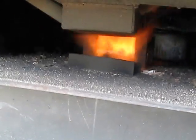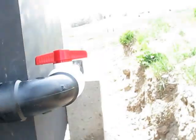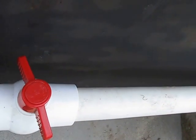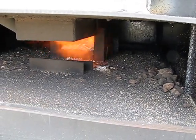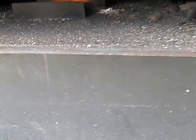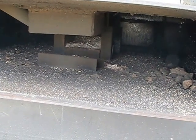I'm happy to know that the two-inch pipe puts enough air into the primary to get it hot and burning well. But with the valve nearly shut off to get secondary air, I'm thinking the primary is going to probably die out. I opened this up to see if the secondary goes out — there was a big burst and then it went out.